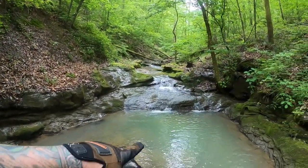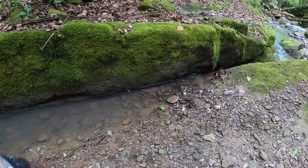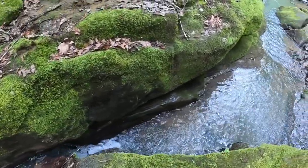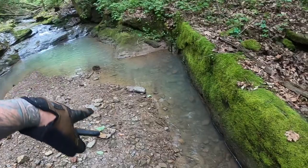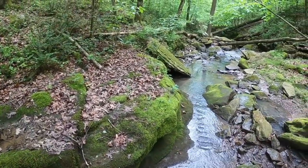I've hiked this and I'm trying to find the steepest decline in about 100 feet linear. I think I've found a good spot. I'm finding a place that will catch water — this can be dug out, and it's a natural place to channel down right through here. I get a good drop off, and the drop off is pretty steep. I'm thinking I could dig this out a little bit, dam it up a little, put my PVC right through there, and go straight down.